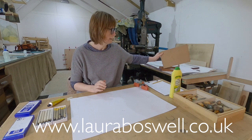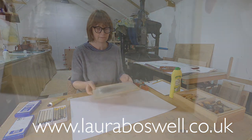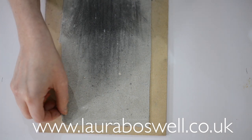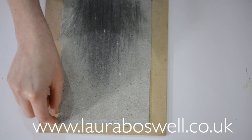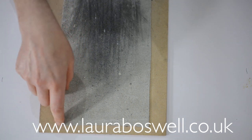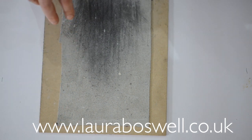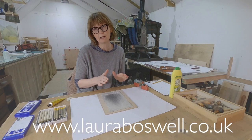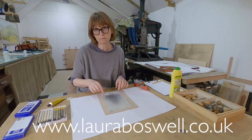In order to do this, ideally you need a piece of leather. Here I have my own honing pad that I've made from an old armchair. A belt from a charity shop or the inside of an old handbag works fine — it doesn't have to be fancy leather, just a flat piece. I'm using the inside of the leather, not the shiny outside. I've stuck it down to a sheet of MDF to keep it flat so it doesn't wrap around the tool.